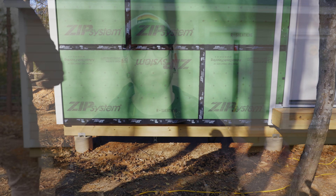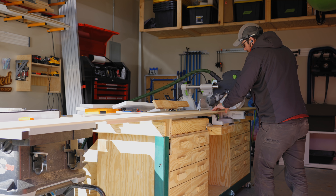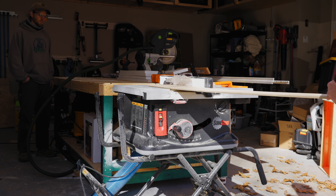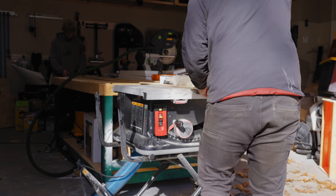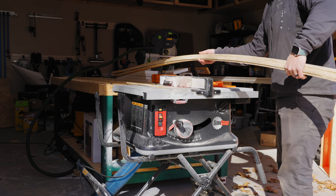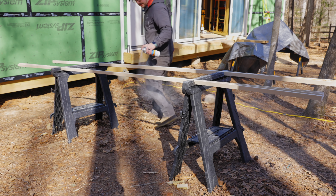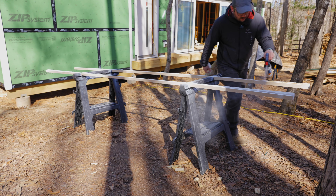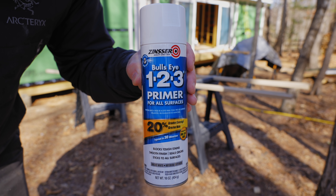With the tools out of the way, let's talk about the basic process of installing lap siding. First we went around and measured the distance between our trim boards all the way around the house to see what our longest boards were going to be. Then we rough cut a board to length and ripped some starter strips about an inch and a quarter wide. These starter strips are the first thing you install along the very bottom of your sheathing — they kick out that first row of lap siding and make the angle match the rest of the siding up the wall. After any cuts on this product, we made sure to prime those cut edges, as required by the manufacturer, since it's susceptible to absorbing moisture. We used a rattle can primer and that made life super easy.